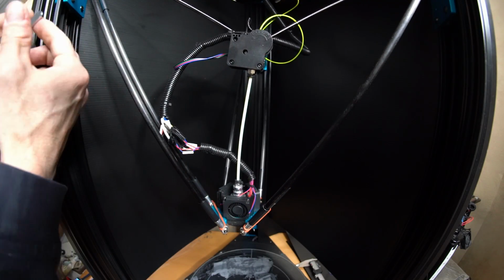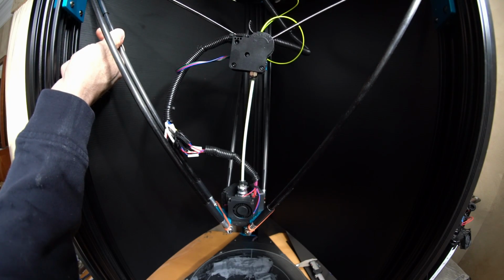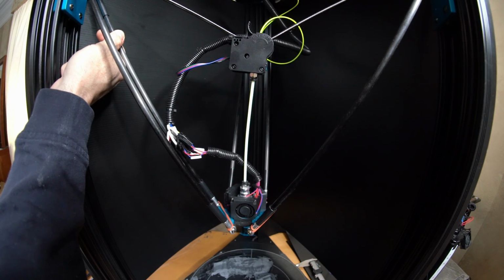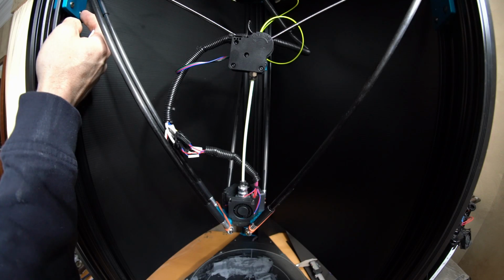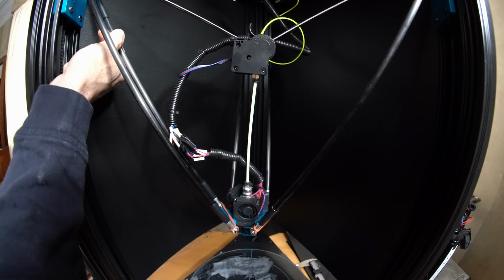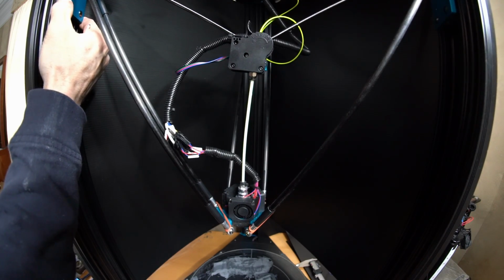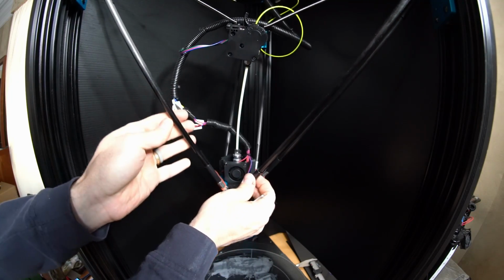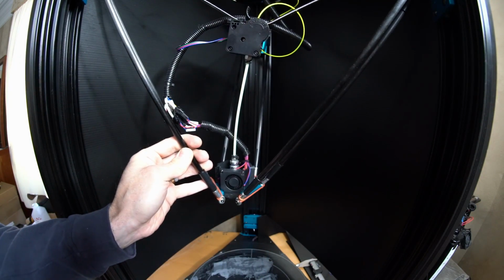And what I notice is that if you make it a little too tight, sometimes you can find like a minor flat spot in the wheel, and this will go jump, jump, jump, jump. So what I did was identify which wheel that was and make it just loose enough so that this is perfectly smooth. And then you check the side to side to make sure there's no wobble. You repeat that for all of them, and you could really perfect it for nice smooth motion.